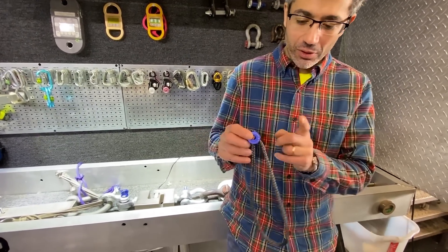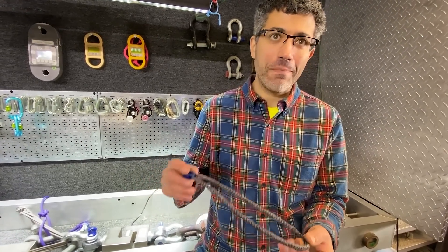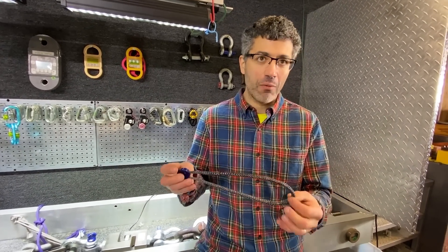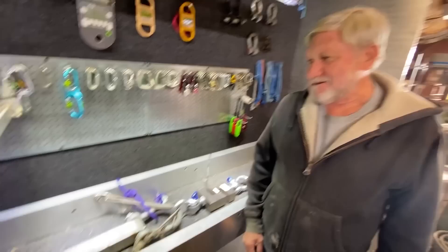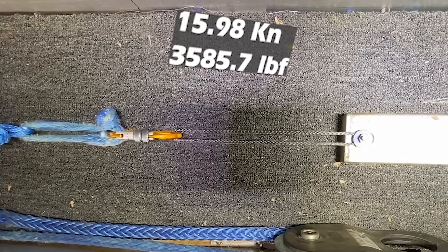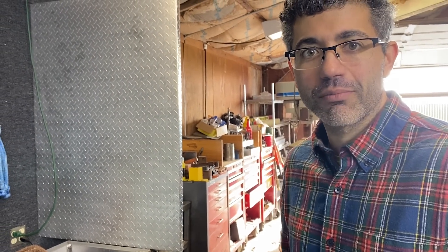So to try to get the actual aluminum hanger to break, we've threaded some 4mm SK99 Max Dyneema cord. This is supposed to be stronger than the 5mm, so hopefully that will break the hanger and not the Dyneema. Larry came to visit and he's going to give us a prediction on what this breaks at — 1,350 pounds. It still breaks around the radius of the hanger itself, which seems like it makes sense for being the weakest point. Over 50% stronger than it's rated for — it's substantially stronger. There's a pretty good safety margin.